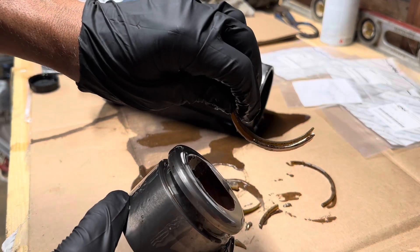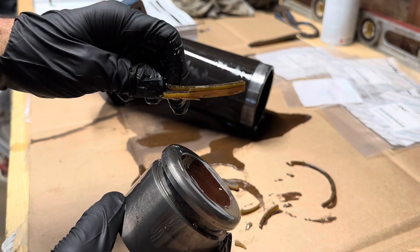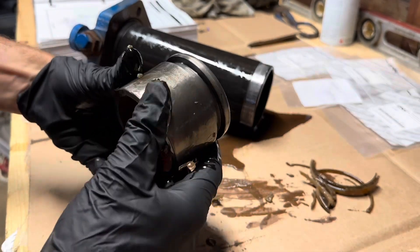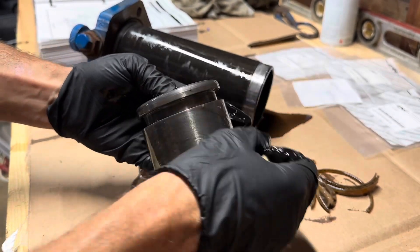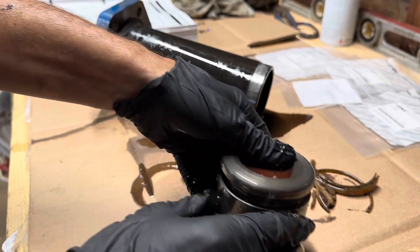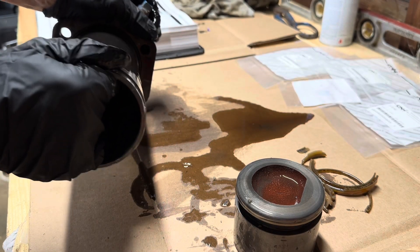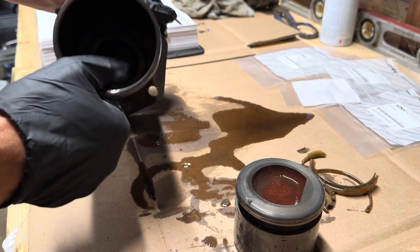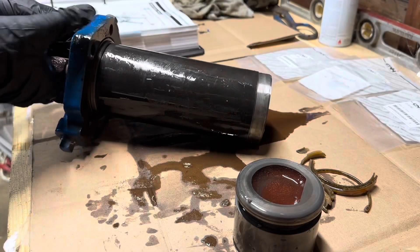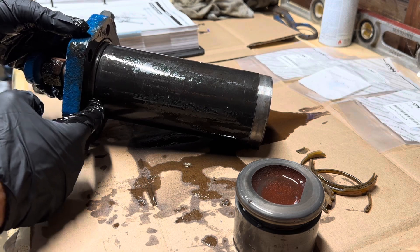This is important: do you see how there's a groove in that seal? That groove is toward the cylinder head side of the piston — we have to put the new one in the same way. Yikes, that thing is just disintegrated. I have to get a clean rag to really clean this up. There's some wiggle there; the issue is if I leave this together I can't get one of the o-rings replaced. I think if I just get a screwdriver right in that crack with a little itty-bitty leverage it will get this to release.